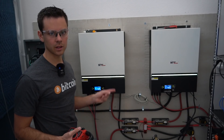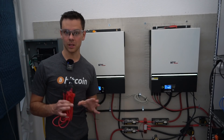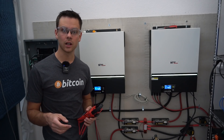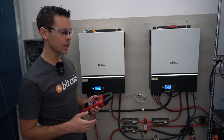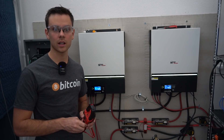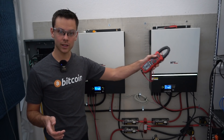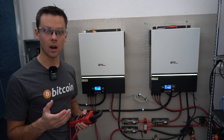I'm thinking that the grounds of the AC output should be on their own bar but connected to the case of my panel, and the neutral should be separate. If you guys disagree, I would love to hear your logic and reasoning. Now if your system is completely off-grid and you plan to never use the AC input terminals for bypass or the battery charger, technically you could earth ground the panel on the AC output — but personally I would not do that. I would run it completely as a floating system. But if you plan to ever use the AC input, use earth ground only at the AC input at one spot. Do not create a ground loop.